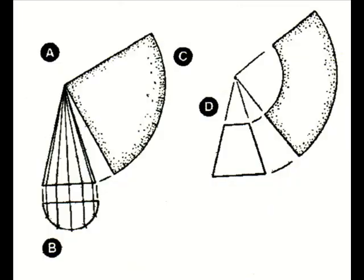These were the instructions I followed in order to lay out the cone, and I quote, "A cone with a round base is easier to develop than one with a square or other straight line base. A side view would already show the length to be used as radius, so there is no need to find the equivalent of the true length of a side of a square cone. A line drawn with a compass having its point on the apex of the cone will give the developed shape of the base. But what is not so easy is getting the length around the base.